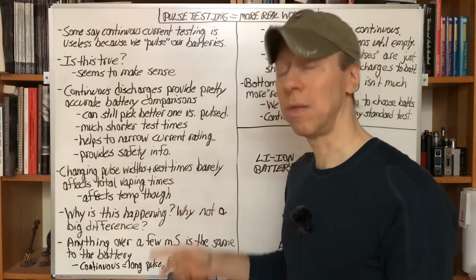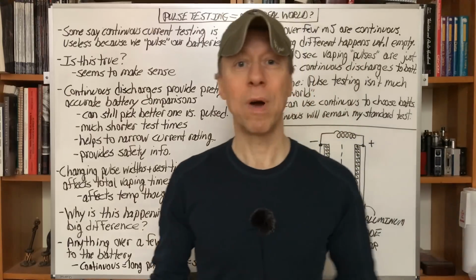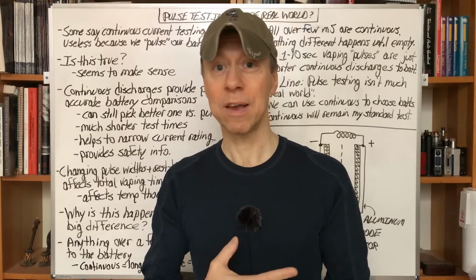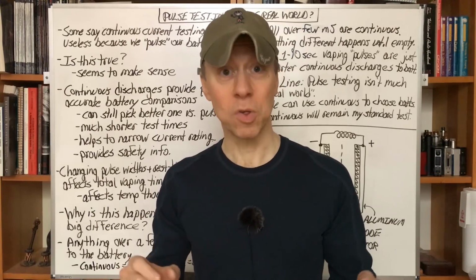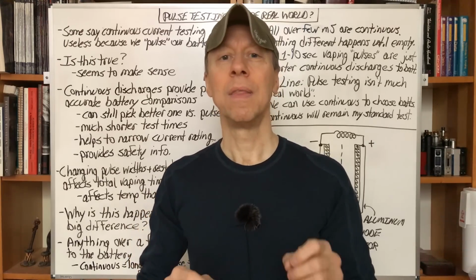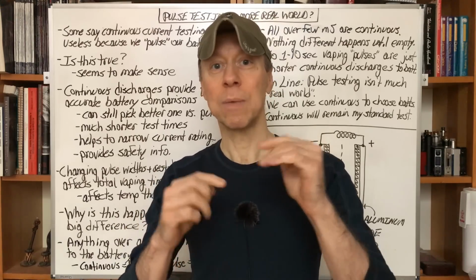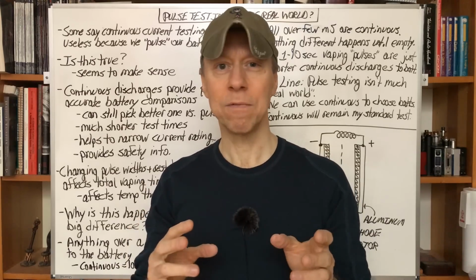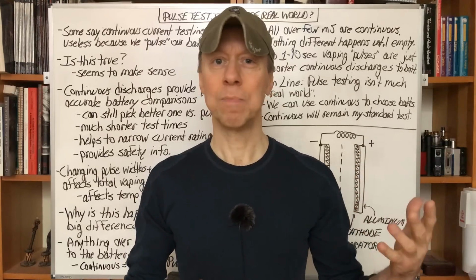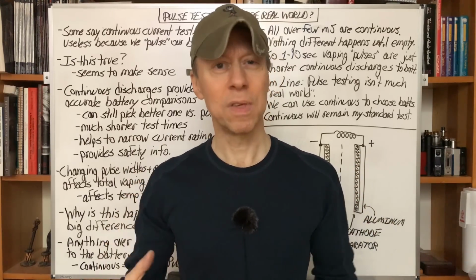Well, I did all those tests and it took about a week, actually almost 2 weeks, to test those, going from 1 second, 3 seconds, 5, 8, 10 seconds, 5-second rest, 15-second rest, 2-minute rest, and then these bursts that I ended up using, a burst of pulses and then nothing for 2 minutes. There was only a 1 or 2% difference in the overall running times, but the relationships were still the same. No matter what kind of pulses I took or the rest time between, the better performer for any of those pulse current profiles versus continuous was still the same.